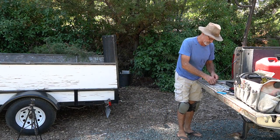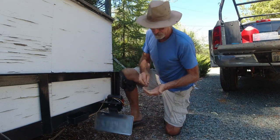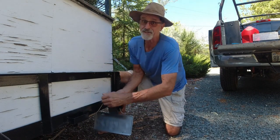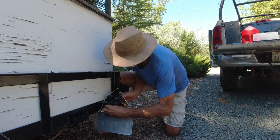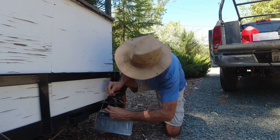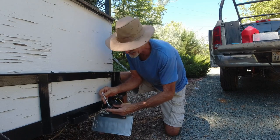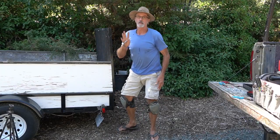And it came with all the nuts and bolts and mounting hardware. So each side has a washer and a lock washer, a little nut that goes on there. Looking over here, another way to know it's the right side, all the wires are the right colors. I did not connect the ground wire to this bolt here, and without that, it's just not gonna work. Slides on there. It's so simple, I forget the simple things about it. I want to get it snug so it won't come loose, but this thing is plastic, so I don't want to get it so tight that it breaks the plastic of the light here. All right, looks good so far.